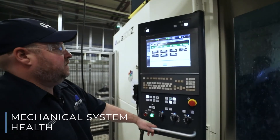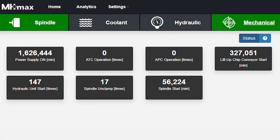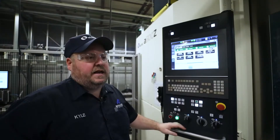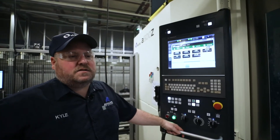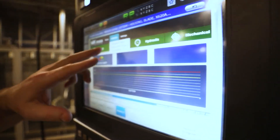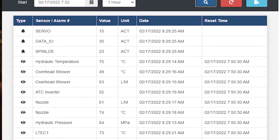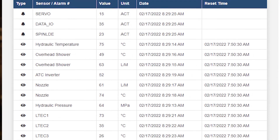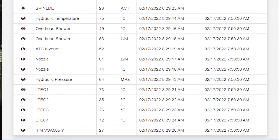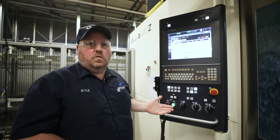From the mechanical side, this is basically just giving you all your information of power-on time and everything—it gives you a status. It gives me an indicator when I have to schedule service with Makino to come in and do preventative maintenance, assisting with our team and technical equipment's team. If there is an alarm or a warning, you would go to your analytics and go to your trending. Any alarms or warnings that would be trending would show a description of value and the date and when it happened, giving you detail to help troubleshoot the problem from when the alarm occurred, whether you were unattended or not.